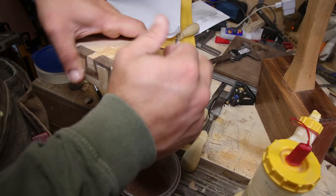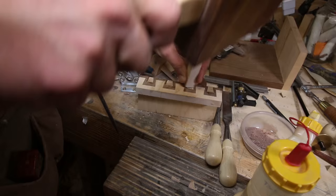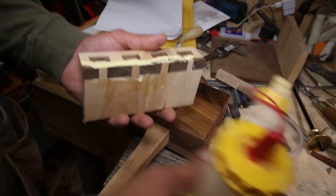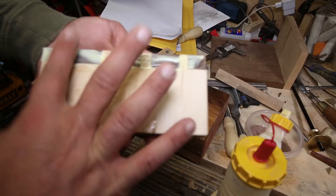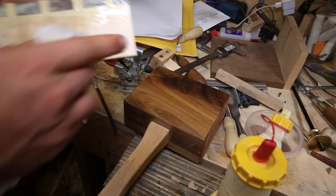We've got that glued in there. Now I like to make sure everything's seated in there good. Everything's tight and you can see we have a couple gaps right there — little gap there and there. And then I have this piece of chip-out here. So what I like to do is just take some glue and go over my joint, rub it in with your finger, kind of smash it into those grooves. Same thing here — just really smash it into those open spots and rub your finger across.